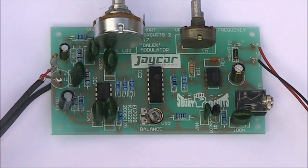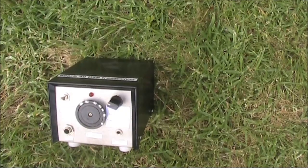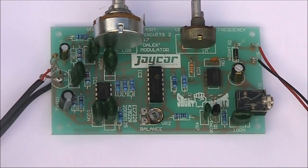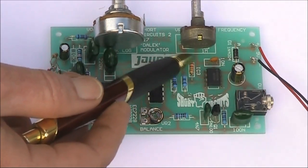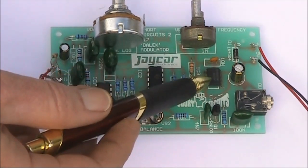That was useful for different applications — for instance, if you're trying to receive lower sideband on an upper sideband receiver, or improving reception of double sideband on a direct conversion receiver. However, there are other applications as well, especially if you shift the 3 kHz local oscillator signal.